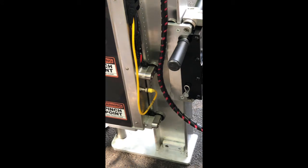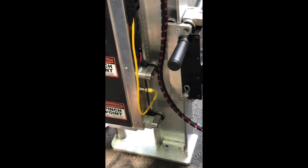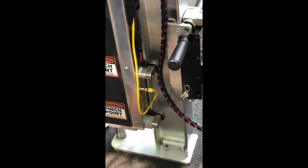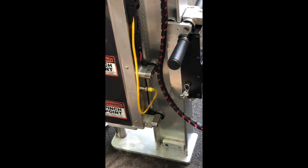You should have the sapper in the trailer hitch mount for stability — that will keep it from accidentally falling over while you're performing these operations. You also want to be ready to catch the derrick when those rollers start coming off. Have it set up with the bottom safety pin in and the handles in the hook, ready to start disassembly.